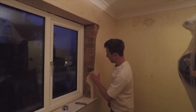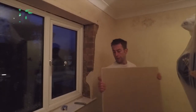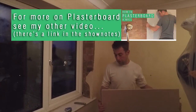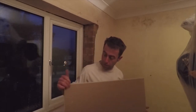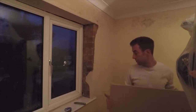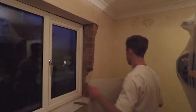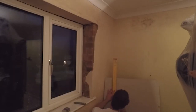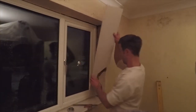The first thing we need to do is cut the plasterboard — this stuff here, 12mm thick — to shape, and then stick it to the wall. When using plasterboard you'll see there's one side that's brown and the other that's grey. The brown side has a paper on it — that's the side that goes against the brickwork. Make the measurement, cut it, and do a quick test to see if it fits in place.